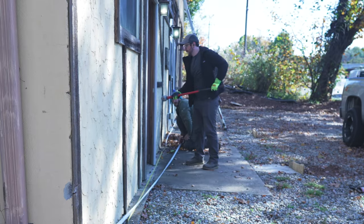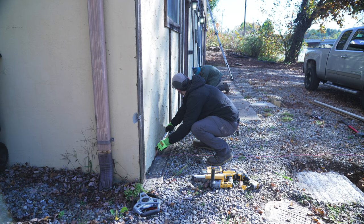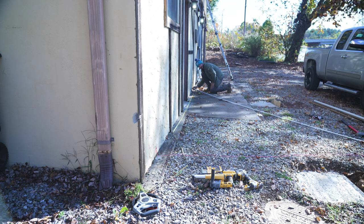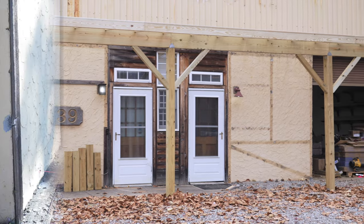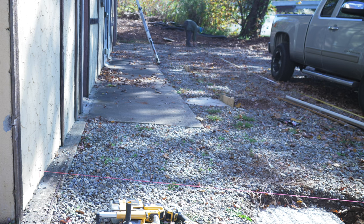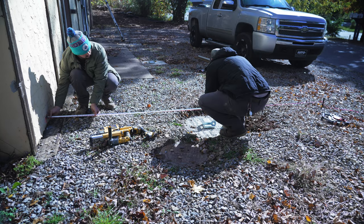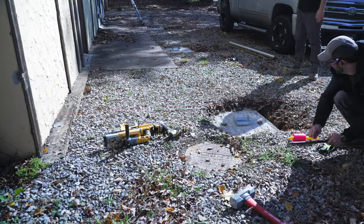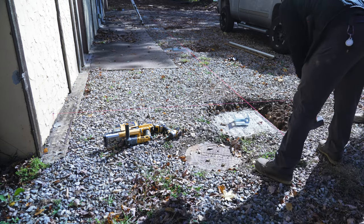This door trim, which used to hold a storm door that had since fallen off the building, was in the way, so I removed it to get a better measurement. I'll be removing all of these crappy storm doors once the porch is built since they won't be needed. After getting the second line added, we measured between the two lines to check for parallel and thankfully they were perfect. Next we set up our third string line and marked six feet two and three-quarters of an inch from the building, representing the back face of the post, then pulled the line between those marks.